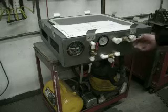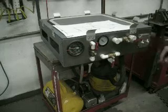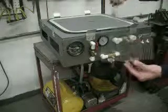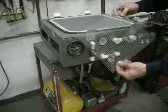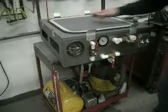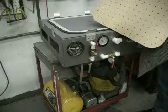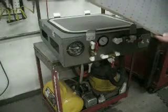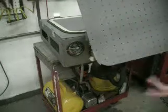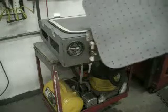We have a piece of wire mesh — chicken wire or wire mesh — and I found that really helps. We actually get so much vacuum here that it sucks pretty hard on the bottom of our platen. The platen is a piece of MDF, a half inch thick, with a bunch of holes drilled in it. I used a pegboard as a guide — I just put a piece of pegboard on top and drilled a hole through every hole in the pegboard.